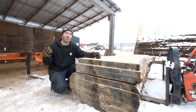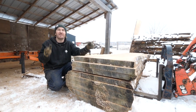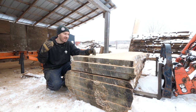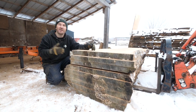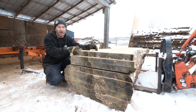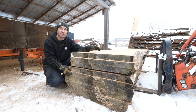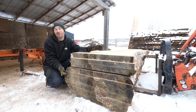So we're cutting 5/4, you know, cherry, walnut, all sorts of smaller logs, 14-inch, 18-inch diameter. And you can cut faster and quicker in those kind of widths, whereas in the long mode, you do have to do a slow cut. So you look at a log like this, and you can get through with one blade before it dulls, but usually it's actually two blades.